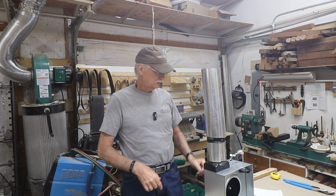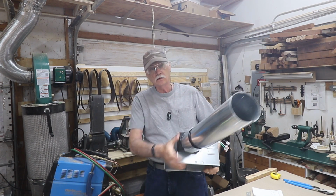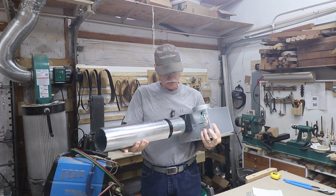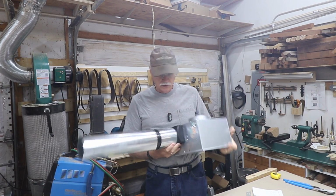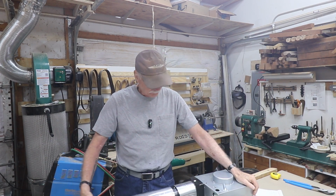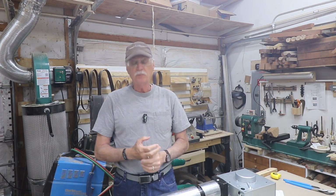This is what I came up with. So this obviously mounts fan down, like so. This section here goes back in through the hole in the wall, through the rim joist. It has a little bit of flexibility so that I can move this around if I have to. It still has a really good seal regardless, and I'm going to seal up around the hole, of course, with the foam, which is going to keep humidity from coming around this piece of ductwork.